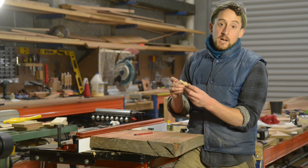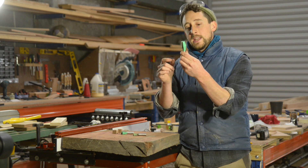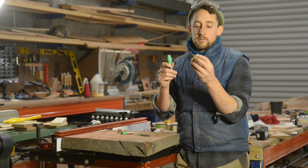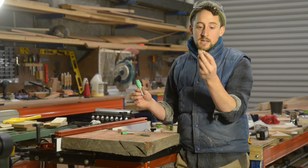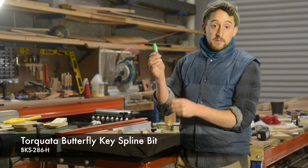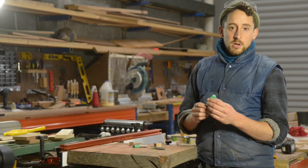That's a really good application of these as well, and it's a simple way with this butterfly key spline bit to make a bunch of these that match perfectly in one go. As you can see, it's a pretty handy little bit — a great natural companion to these dovetail bits and a really nice simple way of making a lot of little butterflies that are neat and you don't have to cut them by hand, which can be time consuming. You can grab this Torquata butterfly key spline bit from Timbercon on their website at timbercon.com.au or at either of their stores in Perth and in Melbourne.